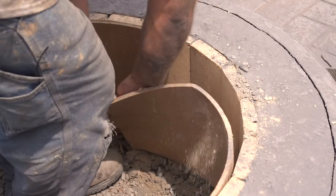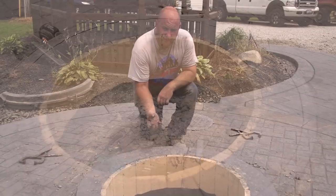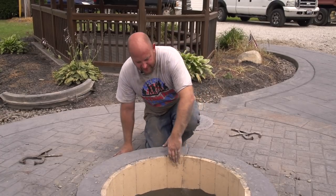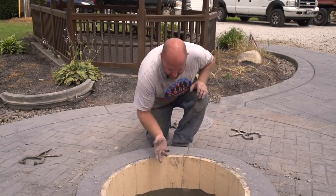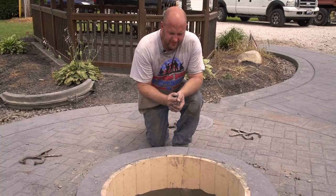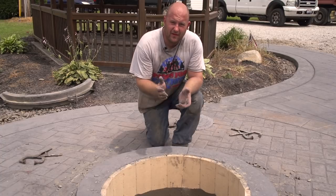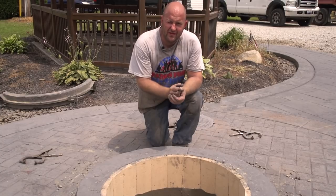You can tell that the fire pit filled in really nice — it really came out good. The pie shape that this creates in the back kind of allows the concrete to go in there and lock everything together. Also, by creating this lip, you're pouring the concrete underneath these bricks, which helps to hold them up. Next we'll fill this up to about this level with some type of stone — that'll allow the fire pit to drain and also protect so the concrete doesn't get direct fire hitting it. That's our Technique of the Week, and if anybody has any techniques or tips they'd like to share, we'd love to hear them. Thanks for joining us and have a great rest of the week. We'll see you next time.